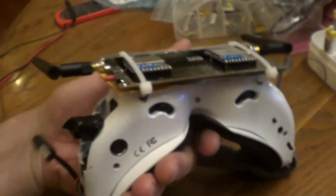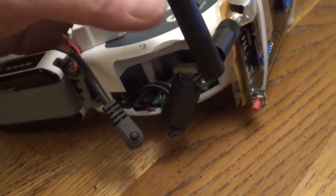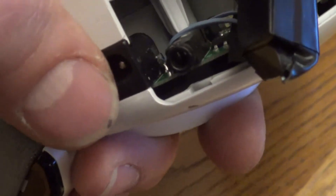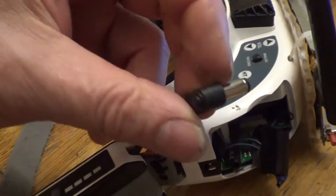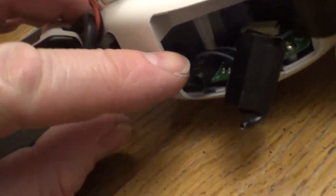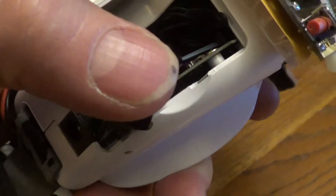Here's my work in progress. I wanted to test it out before I neaten it up. The power converter is right here — it goes 4.5 to 9 volts in, 9 volts out. Notice I'm just wired up right on my DC input. I also removed the polarity protection diode because that's a half-volt drop which hurts your efficiency. And using this type of battery, it's impossible to do reverse polarity, so no need for the polarity protection diode. You'll see it right on the back side — I just jumped that out, got my plus and minus going into my power supply.